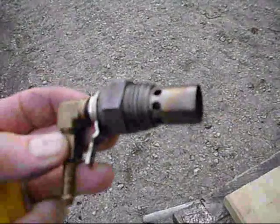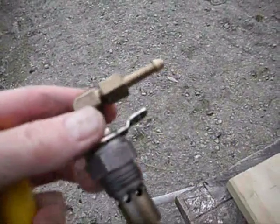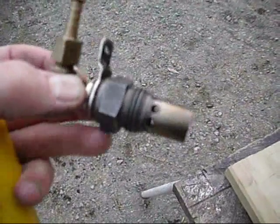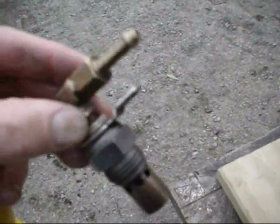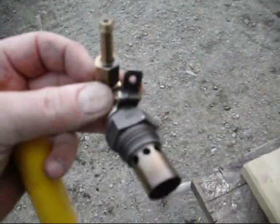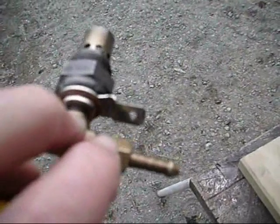Here's a close-up view of the thermostart. You can see I've got a brass connector I can put on here so I can connect up the diesel line. It's got a thread on there which turned out to be 7/8 inch UNF, which was a bit of a pain to find something to fit. The tab that sticks out for the electrical connection was made to have a push-on connector — I've drilled it and tapped it to put a screw in it, because push-on connectors just fall off vibrating tractors.